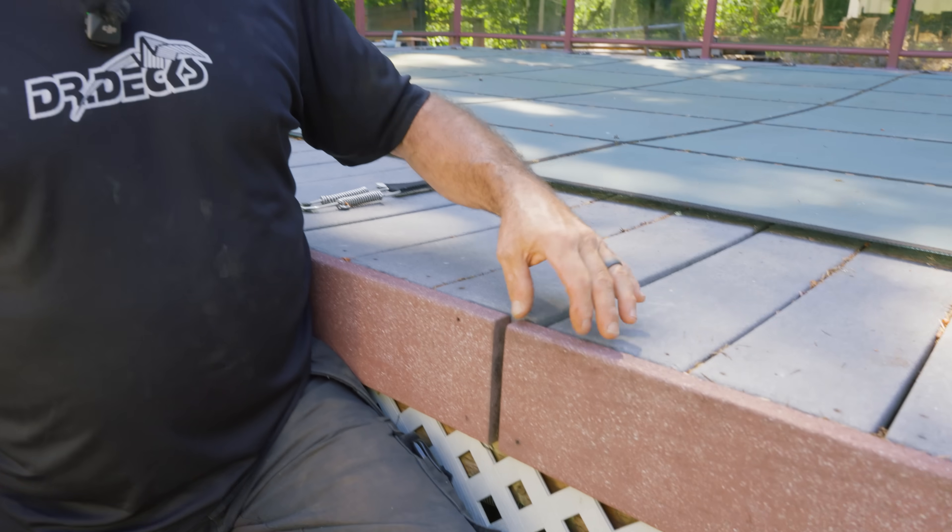What we're talking about mostly today is contraction. Expansion happens during the year in thermal climates — it might get 30 degrees or into the teens where I live, but today it's going to be 90 degrees outside. So this material over the years is moving back and forth, and the framing usually shrinks. It may swell a little in winter but it's going to shrink a certain amount and stay in that shrunken state. If I had the option nowadays I'd source kiln dried after treatment materials or go to an alternate material like aluminum framing that doesn't move around once installed.